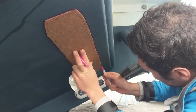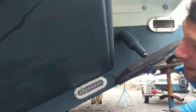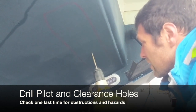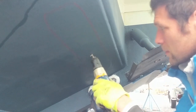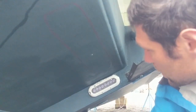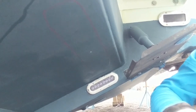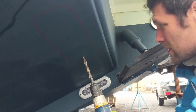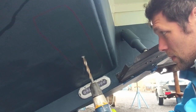Once you have your lights templated, you're going to drill the through hole for the wire. Triple check one last time that you're not going to drill into anything. On this aluminum Armstrong bracket, we're using a pilot bit to make sure the hole is centered, then coming back with a bigger bit. You want to make sure the aluminum is sealed from the inside with 4200 once the light is mounted. We started with a small pilot bit and slowly went through with a larger bit — about a 3/8 or 7/16 bit.